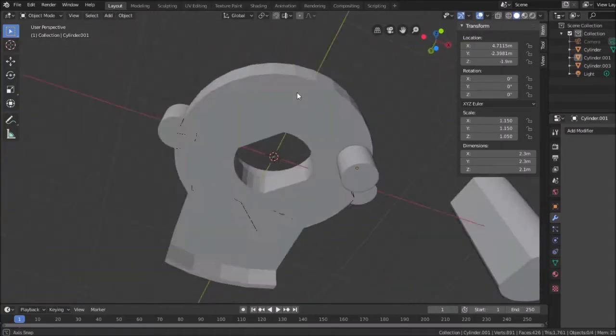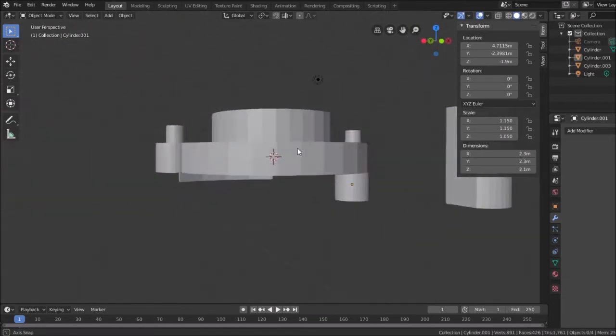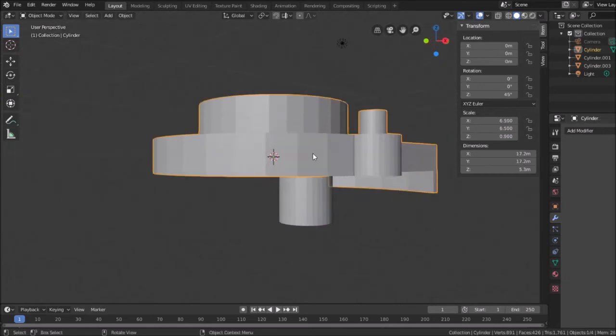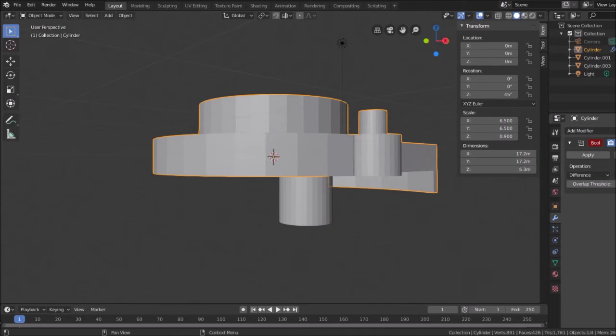Because in order for me to do anything with this as a 3D printed object, I'm going to have to export this object as what they call an STL file. But first I have to merge this because I have two separate objects. I have this, which I'll add a Boolean modifier for